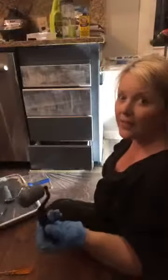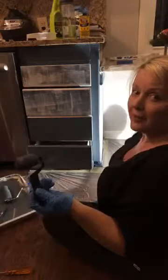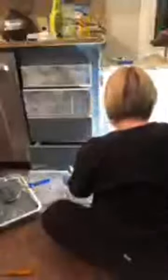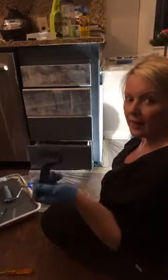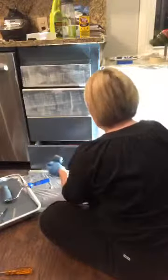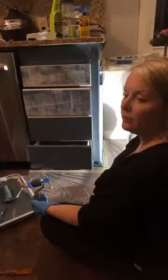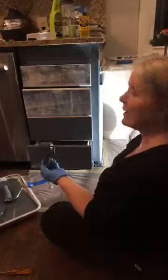You can't really see the color very well on the video, but I'm going to do a blog on the entire renovation so you can see the before and after of the whole house. This is probably the only part I had to completely redo — the kitchen cabinets. They had lots of layers of latex — like an oil and then layers of latex — so with that you want to make sure to sand it down first and then apply an oil-based primer. Then this is latex that I'm going back over it with, but it's fine.